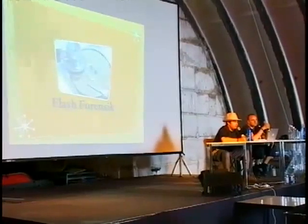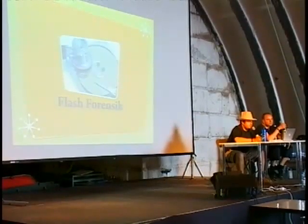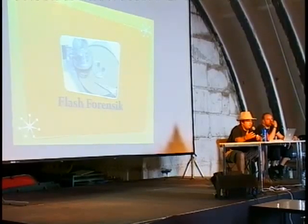One of the reasons for this kind of behavior is that a lot of these manufacturers — for instance, M-Systems is one of the larger ones that has been recently bought by SanDisk — what they do is they buy flash chips from whoever sells them cheapest on the market. It could be LG, it could be Samsung, it could be Toshiba, it could be some company in China that we've never heard of, and they repackage these things into so-called flash modules that are ready to use for mobile phone manufacturers. They put in the flash controller that speaks correctly to the chips and speaks correctly to the mobile phone side, but you never know what is really happening in there.